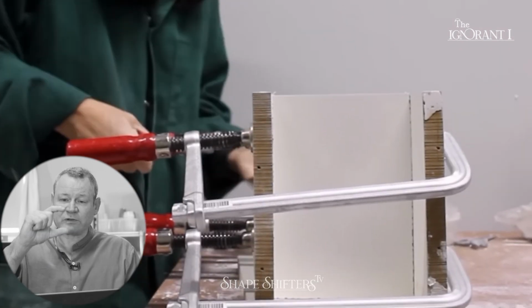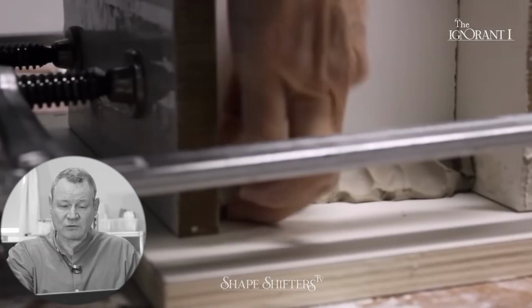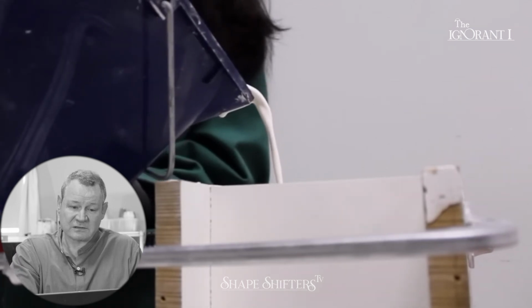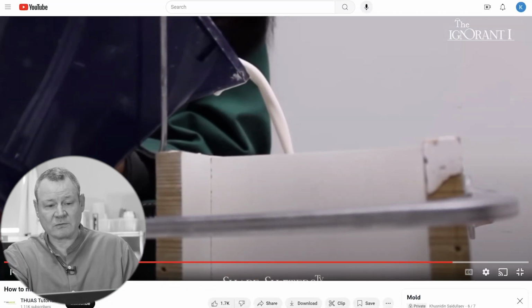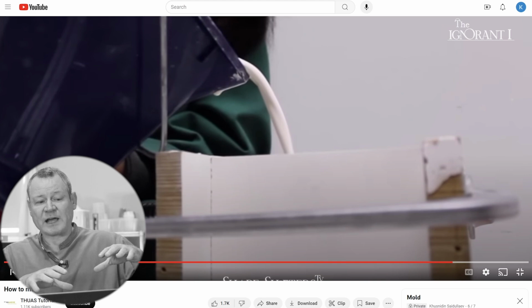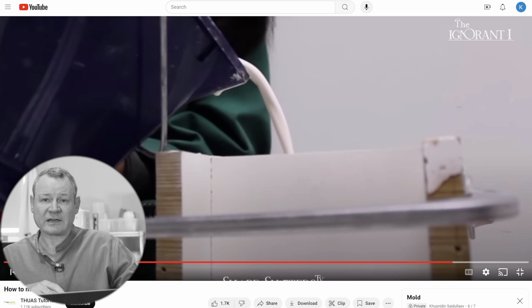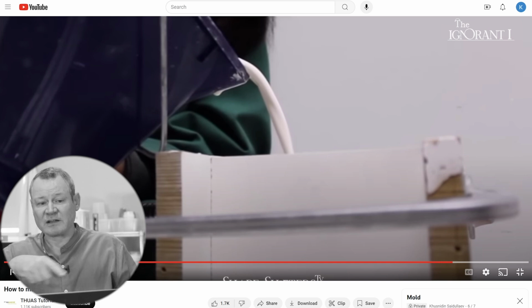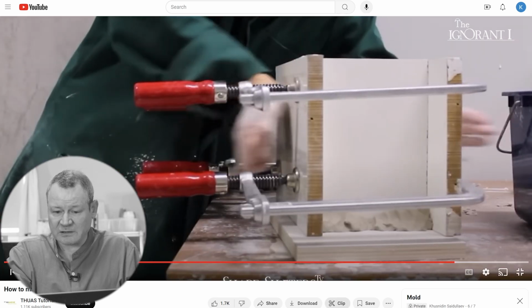So she built a mold that should have been like this. She built it this thick. So it's okay. It's just not needed. When you pour plaster, you see where the handle is on the bucket? The handle should always be back. You never pour over the handle because that handle's gonna drop in front of that stream and it's gonna splash it everywhere. How do I get this back? Hang on.